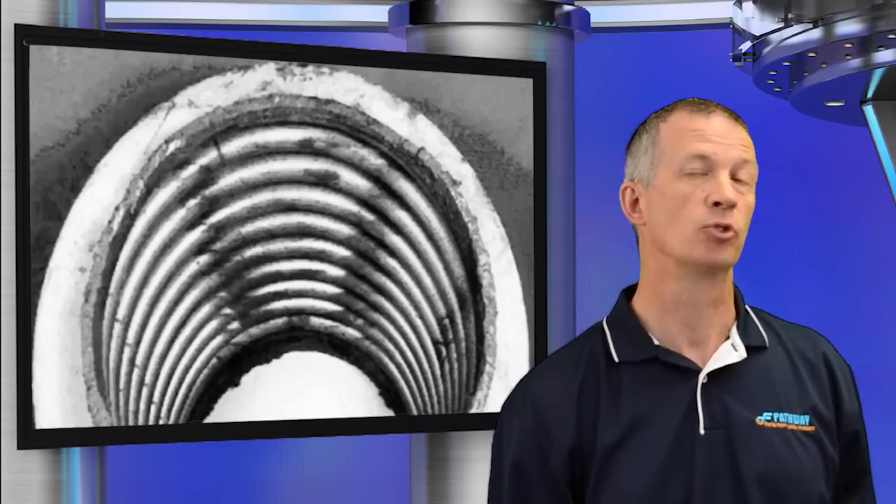Chloride SCC is the leading cause of corrosion failure in bellows. Caustic SCC occurs when the bellows is exposed to caustic substances while subjected to tensile stress. Caustic substances can include sodium hydroxide, potassium hydroxide, and calcium oxide. Besides the caustic, a tensile stress, steam or water, and a temperature above 550 degrees are required. This type of corrosion is common in superheated steam systems. To prevent caustic SCC, it is best to avoid 300 series stainless steels and nickel alloys. Nickel 201 or 200 as an interply is a good solution.